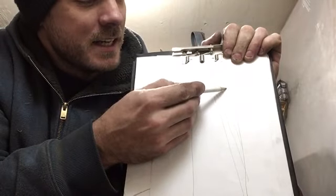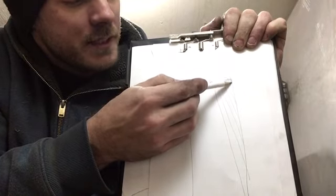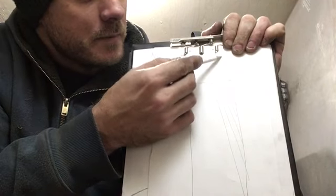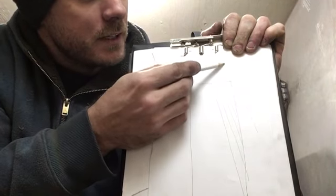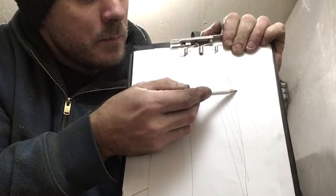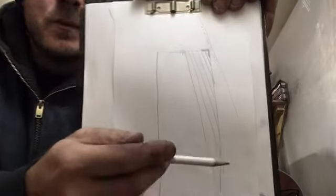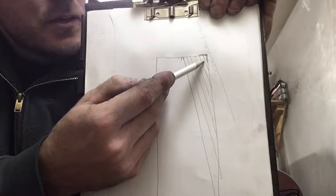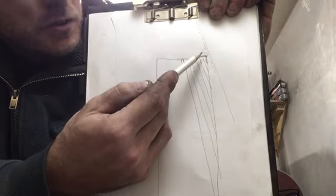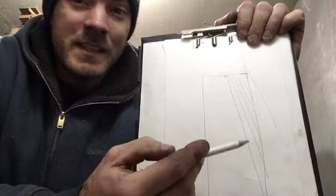So this 90 degrees here at the edge of your blade, that's aggressive as fuck, okay? So this is your belt, right? And it's full of all these little grits. Depending on what grit you're using, some of them are obviously more aggressive than others. But what you're getting is that this 90 degree edge is just shearing off all your little grits, and just dulling the hell out of your belt all the time. And that's called grit shear.